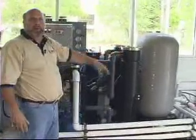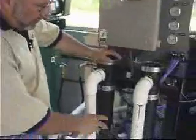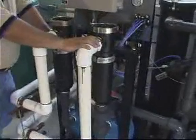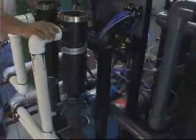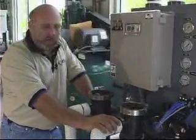And then a bladder tank to maintain pressure for seamless operation. The reclaim system has two pumps on board. We have a 5 horsepower pump for the pressure side that delivers 100 gallons a minute, so it's a continuously operating pump. It'll run off the bladder tank and maintain pressure throughout full operation of the car wash.